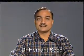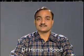Hello viewers, one of the important properties of concrete in its hardened state is its compressive strength. Compressive strength of concrete is important because other strengths such as flexural, bond and resistance to abrasion improve with increase in its compressive strength. The compressive strength of concrete depends upon the proportion of ingredients used in concrete.